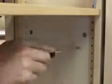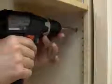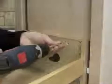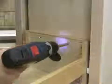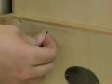You begin by loosening these 2 screws 1/4 of a turn. This will allow you to gently slide your floating back plate up so it is 1/4 of an inch below the top of your cabinet. Next you will tighten your 2 screws that will hold your floating backplate in place. Then you will take your supplied number 8 by 1-inch deep thread screws and insert those into the pre-drilled holes. Then you will finish by placing your 2 screw cover stickers.